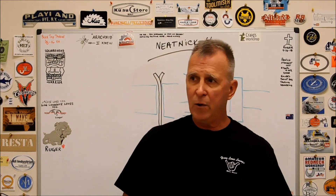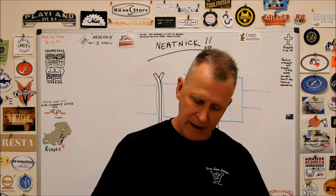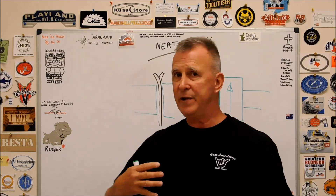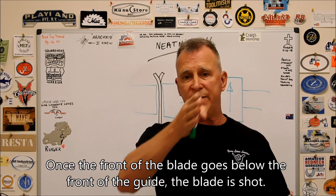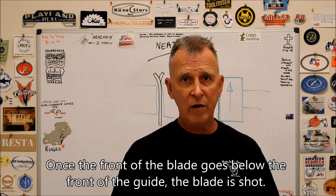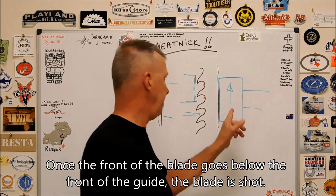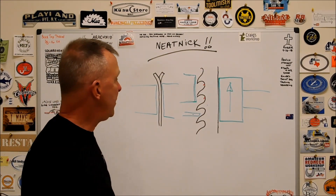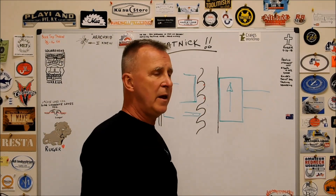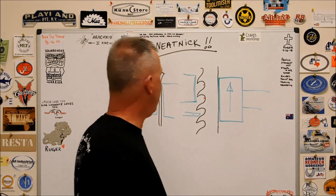What's going to happen if the thrust bearing is too far away? You're pressing on your material, all is good, you're coming up to that line you drew. When you stop, the blade is going to relax towards you because it's flexed from the cut that you just made, and it's going to walk right over the line without you even moving the part. I will show you the do-all that I have — I will show you the rolling setup on the do-all — and I will show you the rigid setup that the Craftsman offers and show you both ways to do that.